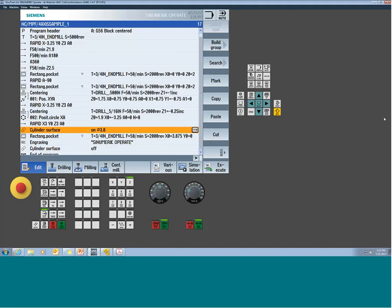Does the arc need to start or end at 0? Nope. You can start it anywhere around your orientation. Can you do helicals in TRACYL? Yes, because you could be doing an X or Y commanded move with TRACYL on, and during that move, since the Y is being switched to an A-axis rotation, you would then get an XA helical. I believe that's probably what you're referring to.